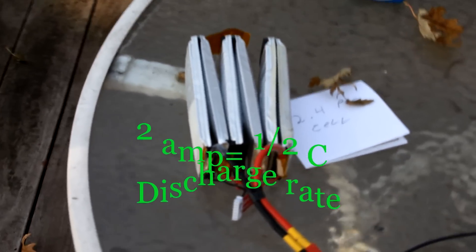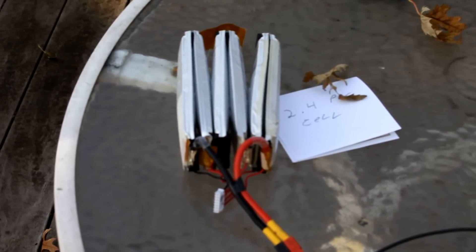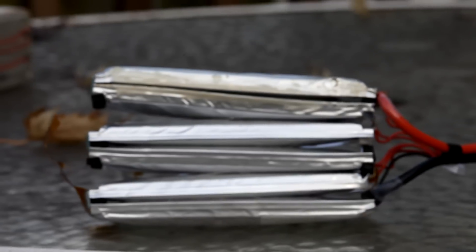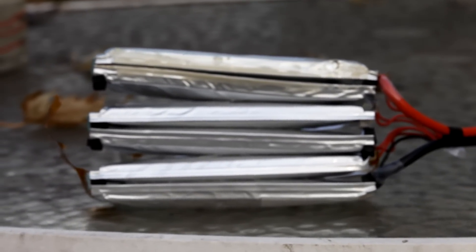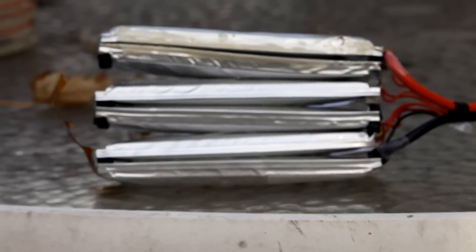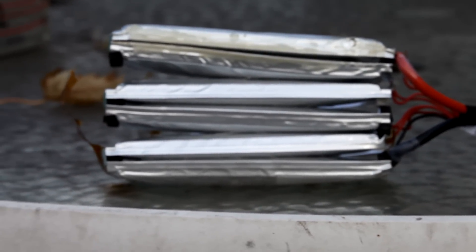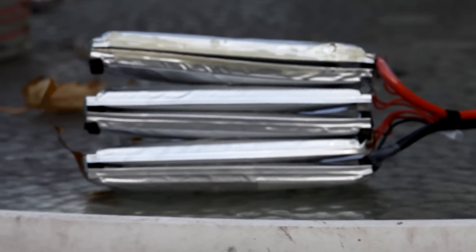You can see how the cells themselves have expanded a little bit. They were slightly puffed to start with — it was one of the early series red pulse packs that had a tendency of getting a little chubby. Here you can see the swelling on the individual cells. This pack was discharged at 2 amps; it's a 5,000 milliamp 6S pulse LiPo pack and has been discharging for a little over an hour. Total pack voltage is now below 0.4 volts. I'll wait until it drops to zero on the discharge cycle, then tie the positive and negative ends together for disposal.